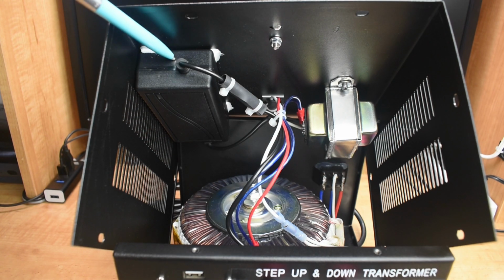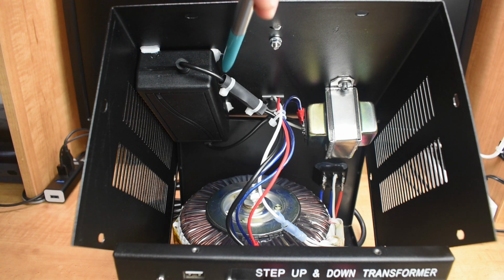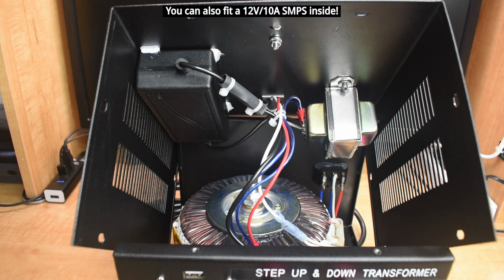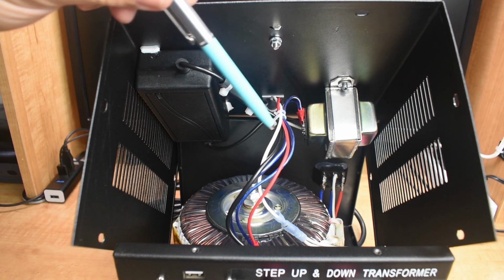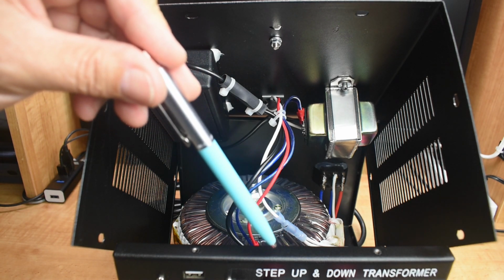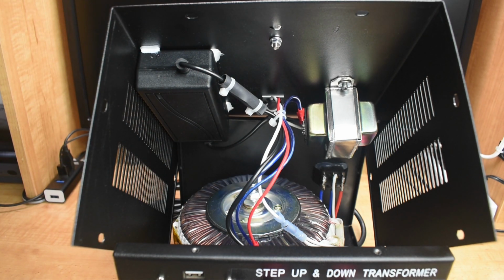Over here is the 12 volt 5 amp regulated output switch mode power supply, bonded to the cover using 3M double stick adhesive and some E6000 adhesive. Underneath the heat shrink tubing is a 6.3 amp fuse, and the wire leads all the way over to here with ring connectors that connects up to the binding post.